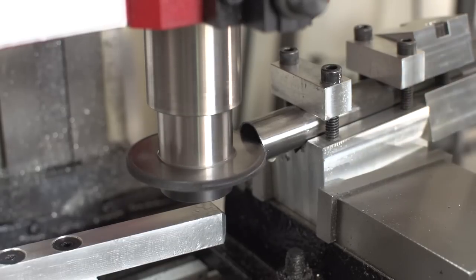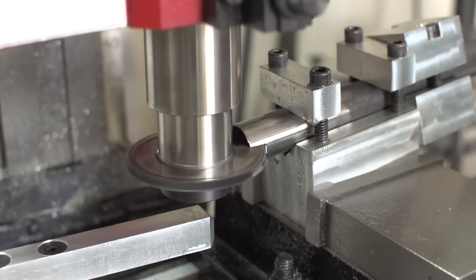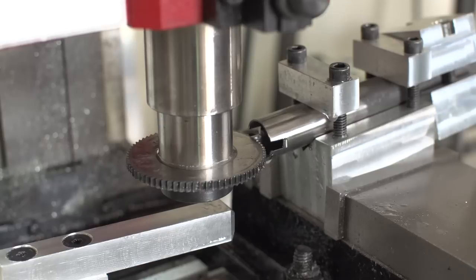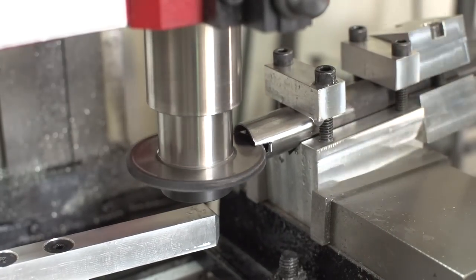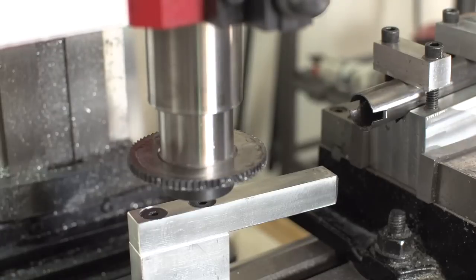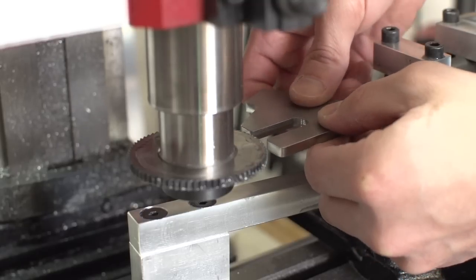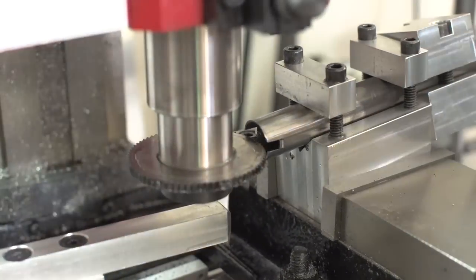And now slitting a notch for the dropout. My cutter is a tad shy of the dropout's thickness, so I'll drop it down a bit to make it wider. And as I always do, I checked to see if the dropout fit in there, and it didn't. Glad I checked. I measured wrong, so one more cut, just a tad lower, and that did the trick.